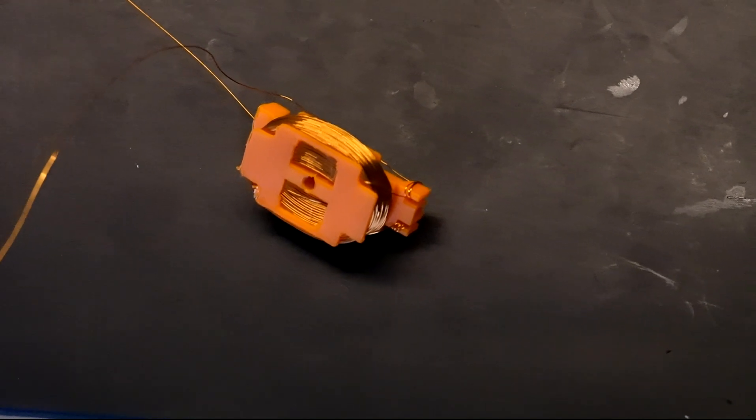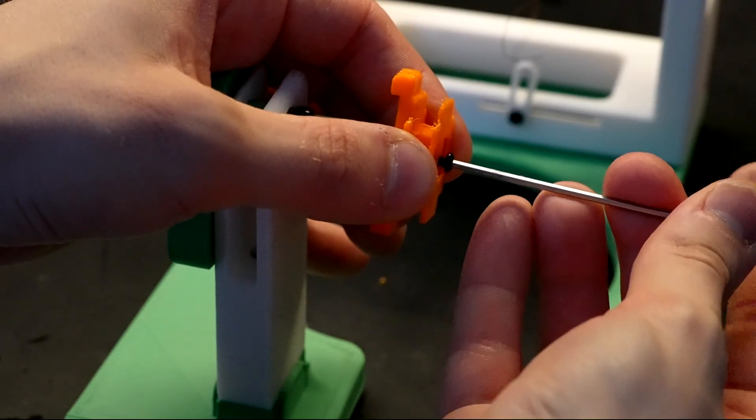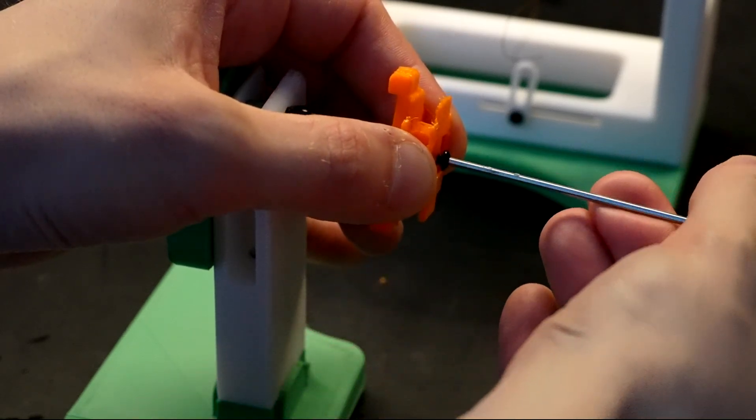Next are the module coils themselves. This generator uses my V3 module coil design — or you could call it V3.5 — because I had to make a minor edit to make it more printable and increase its mechanical strength. I found that the original V3 was very delicate, especially when printed on my larger nozzle, so I had to make the edit to make the design viable. On top of that, these coils are printed on a standard 0.4mm nozzle, which gives them much better print quality, and using the 0.4 nozzle didn't really increase print time all that much. The rest of the coil holder is basically the same as before, apart from the edit I made to the rotor-facing side.